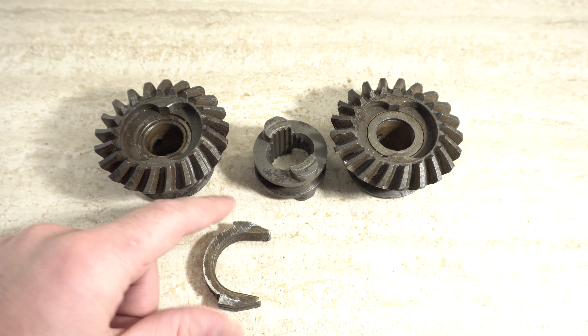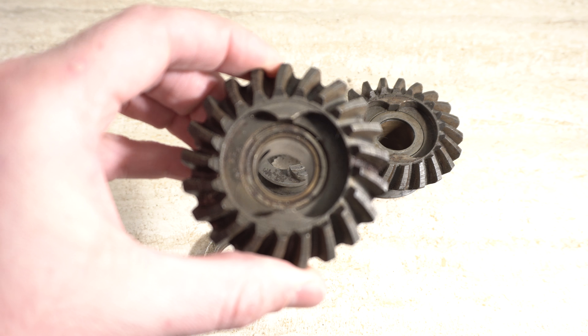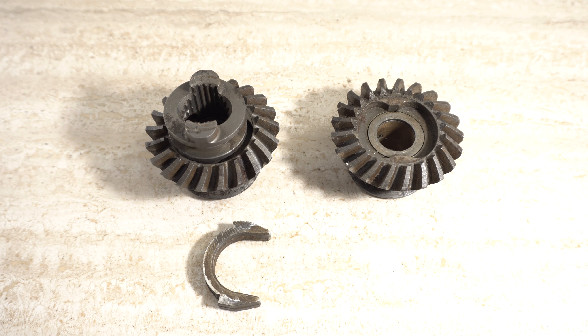This gives you a better view of how the two parts connect. Seeing the actual path into which the shift dog clicks when you go into gear helps you understand why there's a bit of a thud and why the mechanism isn't really smooth. Be aware that the thud shouldn't be too loud. If your RPMs are too high when you shift into gear, you'll get a loud thud. Also, if you go from forward to reverse without letting the motor slow down enough, you need to give it a second so you don't get an overly loud thud while the motor is still spinning fast.